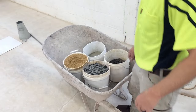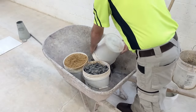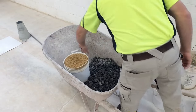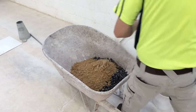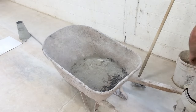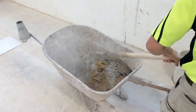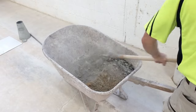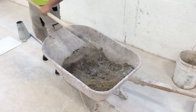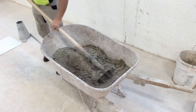The concrete slump test measures the consistency of fresh concrete before it sets. It's performed to check the workability of fresh concrete and the ease in which the concrete flows. It can also be used sort of as an indicator of an improperly mixed batch. This is usually done on larger commercial jobs and performed by an inspector. It's not typically done in residential construction. Maybe in earthquake-prone states for residential construction, something like that.